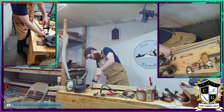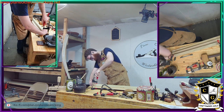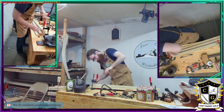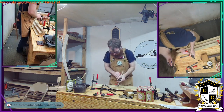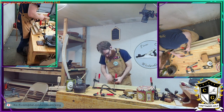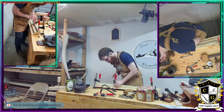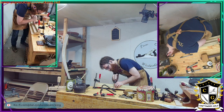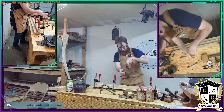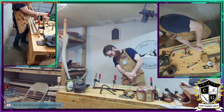This is more about just getting the pressure down. A little bit of a bow here, so that it can set up without a gap. That's really all I'm doing right now. I'm not really clamping it because it needs the pressure. I just want to take out the gap. This hot hide glue also is a gap filling style glue, so it's not really needed, as opposed to PVA, which will not fill any gap if it ever tries.